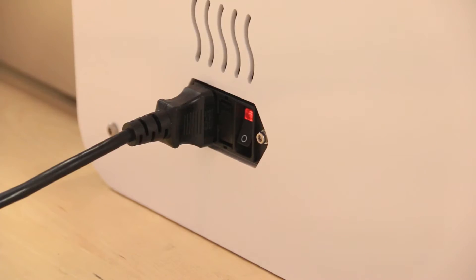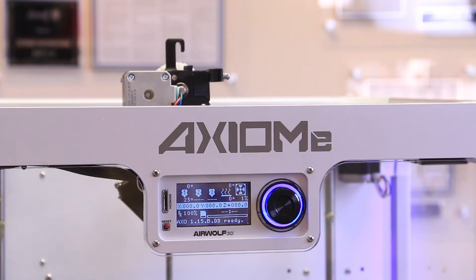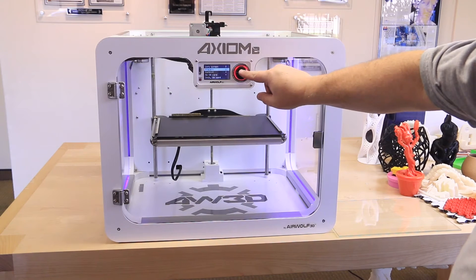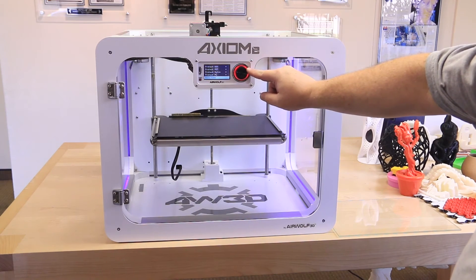Click OK on the dialog boxes. Wait five seconds for the printer to reboot and then turn the printer off and on again. Confirm the firmware version at the bottom of the Viki. Auto-home the printer and make sure each axis triggers its limit switch.